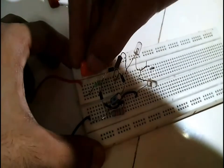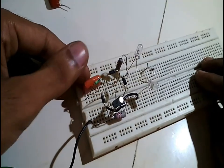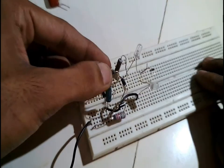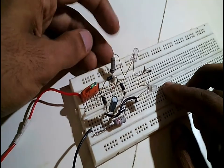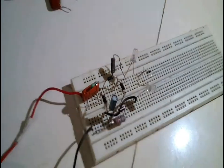I have used the 220 ohm resistor from the old circuit and while building the circuit I'm going to keep the bridge rectifier the same. I have also changed the LEDs and added an extra 100 ohm resistor near the LEDs to protect them from current surge.